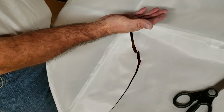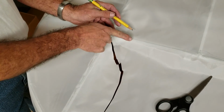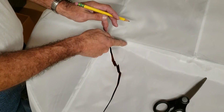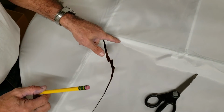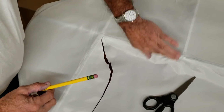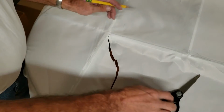And then we're going to come back with a reinforcement tape that's going to probably wrap all the way around that. Some guys will actually just use a 2-inch and come down to the center, the pinked edge, and come around to the center. Iron that real good, because if you think about it, your hinge point's going to be in there, and that's going to be inside, and you're just hardly not even going to see that. Or you can cut the holes in it and put the tape all the way around. But you make your decision when you come into a corner like that.